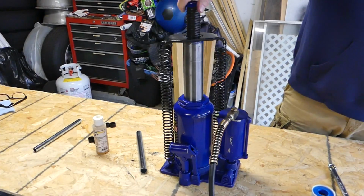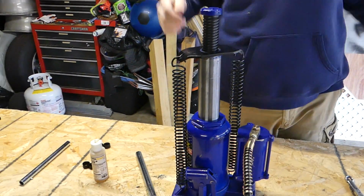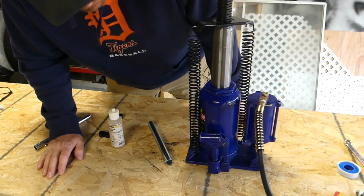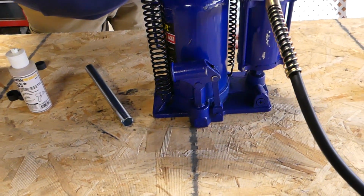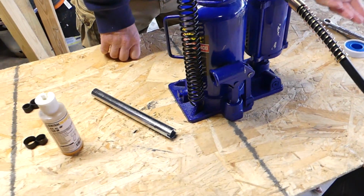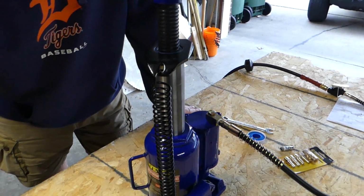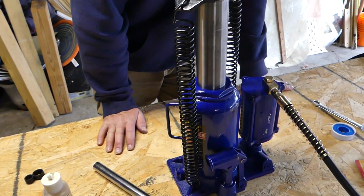That's full capacity there, guys. What I like to do when I got a new toy, or a new tool, I mean, my first use, obviously, I want to look around. I'm checking for leaks, guys. I'm listening for any type of leak that could be happening anywhere. Any air leaks, any of the hydraulic oil coming out anywhere. Fortunately, I'm seeing nothing happen here. So everything is good here.